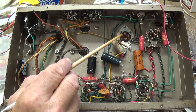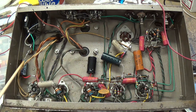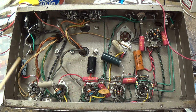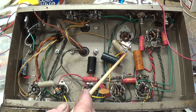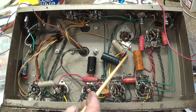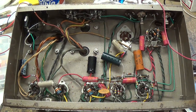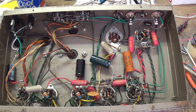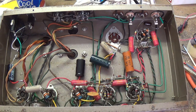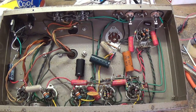As you can see, the wires have been removed from all four of these lugs of this truly awful electrolytic capacitor, and the new capacitors have been wired in at each of the positions. Here's the cathode bypass cap for the 6L6s underneath here. So let's plug it in now and see if it plays a different tune. New filter capacitors — the amp is plugged into the current limiter, the shop guitar is plugged in, and the amp is plugged into the 12-inch shop speaker. Let's see if we can hear something other than a deafening 120 cycle hum.